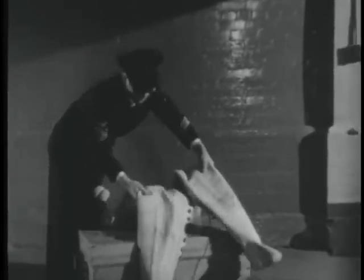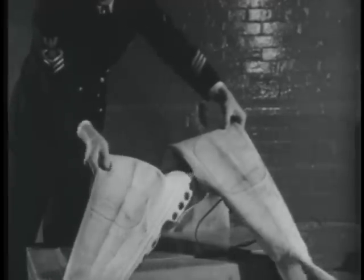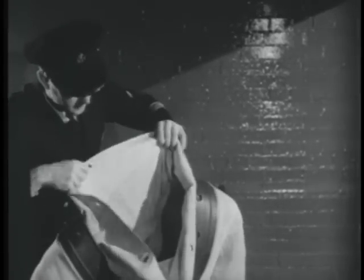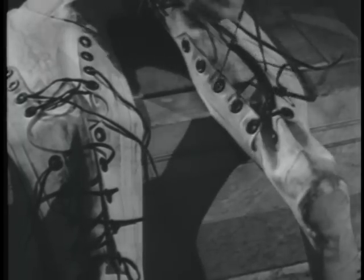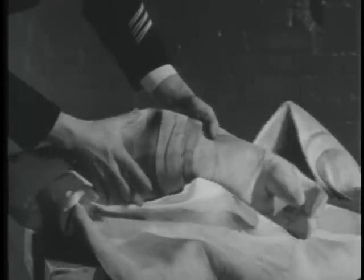The dress itself is made of sheet India rubber, backed and faced with cotton twill fabric. It is reinforced at all points of wear. It has a rubber collar in which holes have been punched to receive the breastplate. Inside the dress is a bib which traps any water that may seep through the breastplate, and so prevents leakage into the lower part of the dress. The legs are made with lacing flaps in order to decrease the volume inside the suit, thus stabilizing the diver's buoyancy by keeping the legs from blowing up with air. For cold water work, gloves are cemented on the sleeve.